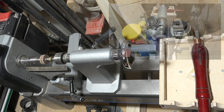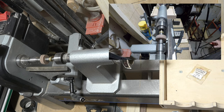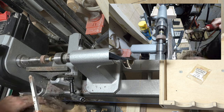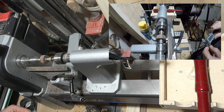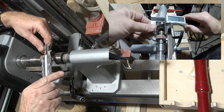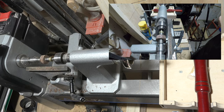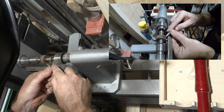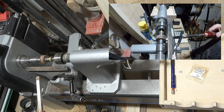The first thing I'm going to do is spin these down to round — right now they're kind of uneven. We'll throw on the face shield and just turn them down. They're mounted on a universal pen mandrel with a couple of bushings to keep everything held together. Taking a measurement: we're at one and eleven sixty-fourths, so I'll give myself a mark close to the one inch mark and turn these down until we get them to their one inch diameter.